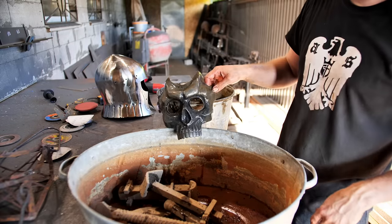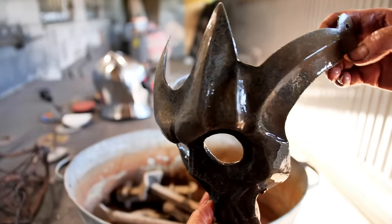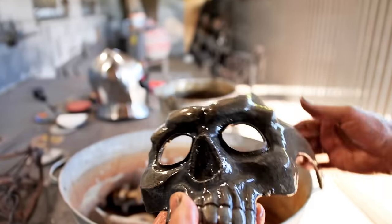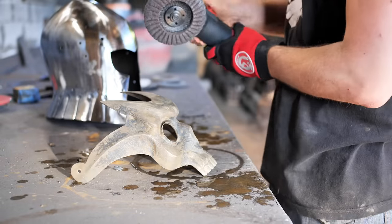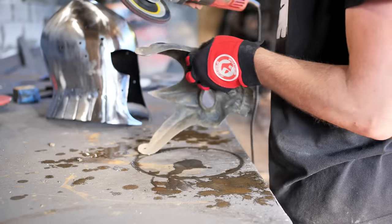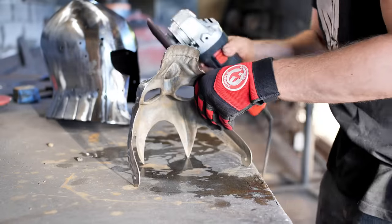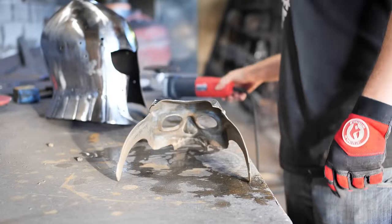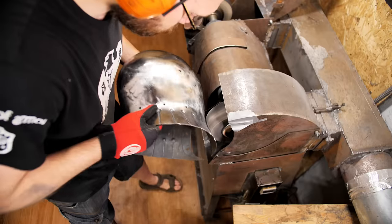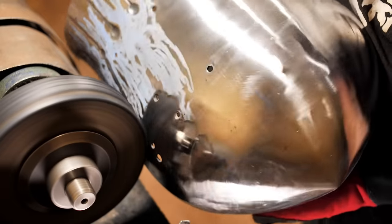After 3 hours, I took it out and it had to be washed from the dirt that was created in the drum. The thing is that I added water and it became easier to remove the scale. It got better, but there was dirt. After cleaning, it was obvious that in some places the surface is clean, but in the grooves the surface is still black. I am scraping the entire surface with Scotch-Brite to clean it. So far I have not been very impressed with the pebbles. I have to keep experimenting.